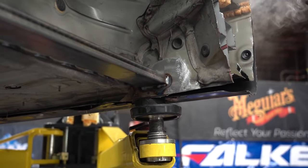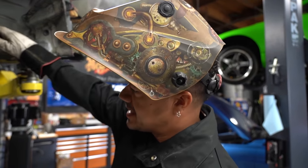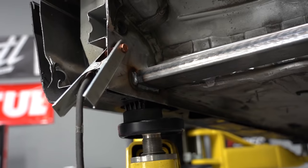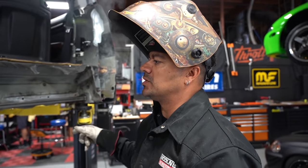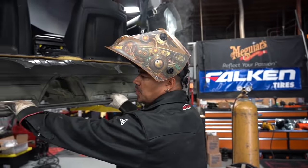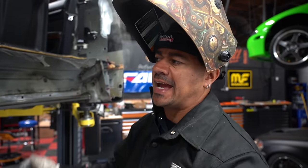Now we lower it and we're gonna weld on the top side on both sides while Mickey gets the L brackets ready for the center support. All right, so we have those points welded. Mickey's working on the L bracket. As soon as he's done, we'll put them here, weld them. They'll be fully supported, and then we'll work on the casters.